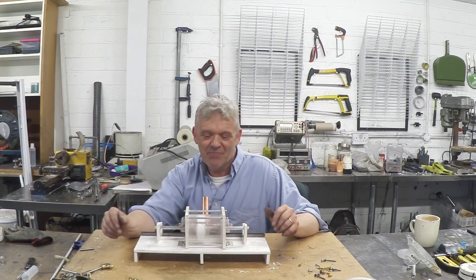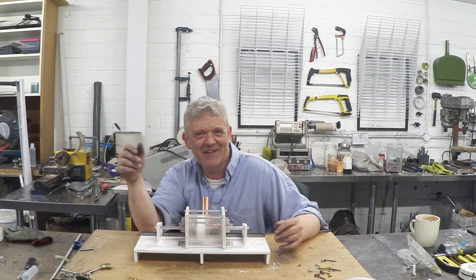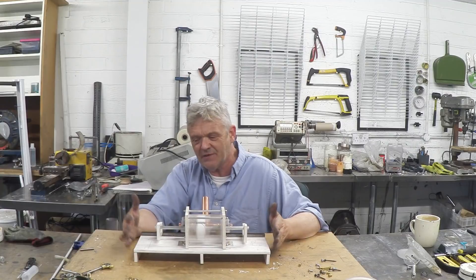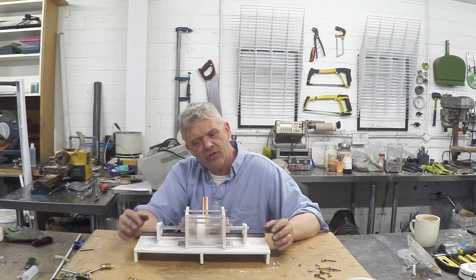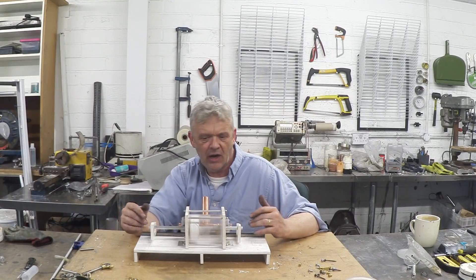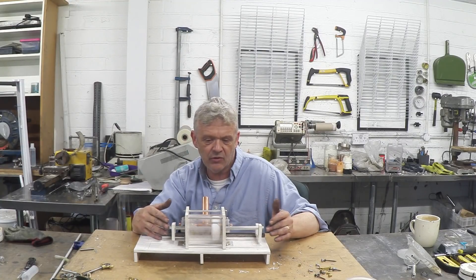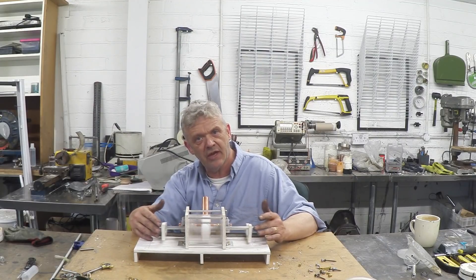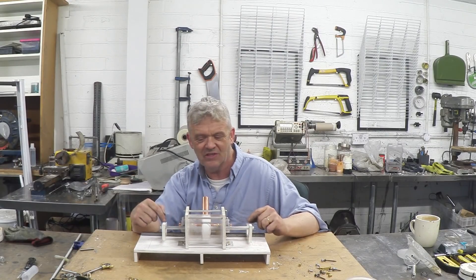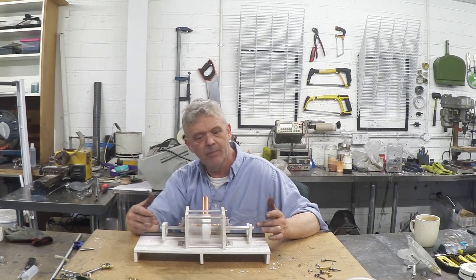That really is promising — that piston is reciprocating as long as I can blow in there with a certain amount of breath. Of course I can't keep blowing for half an hour, but the idea certainly works and that's very cool. This is a first stage effort so I think there are going to be quite a few problems. It still needs something to overcome that position — maybe valve timing, or a spring to bring it back a little bit so it goes all the way.